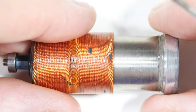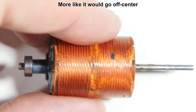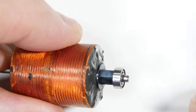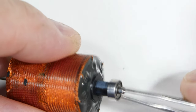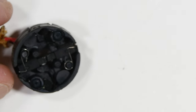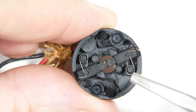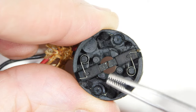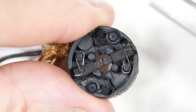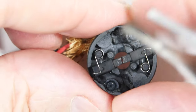One reason these went bad is people would bang the nail gun, the rotor would go off balance, touch the magnet, and fail. On the other end is another ball bearing, and the end of the rotor is finished with epoxy — very nice. For the contacts, it uses two carbon brushes with real live springs. This is a proper set of brushes, not little brass pieces that have been slit.